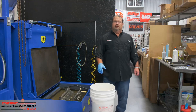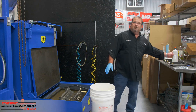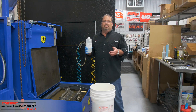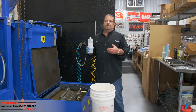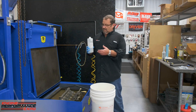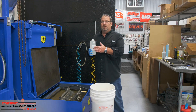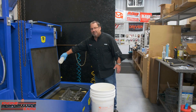Optional with the Silver Seal cleanser for jet wash type systems, Silver Seal offers what they call foam control. This is an option that you can or cannot use. We feel it's a good idea just in case, to avoid any messes in the shop with foaming. You need three ounces of foam control in your jet wash per 100 gallons — and in Tennessee that's one, two, three.